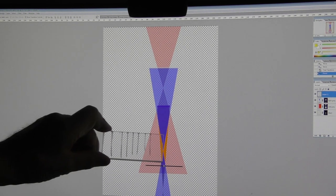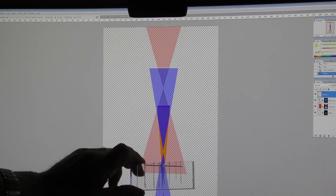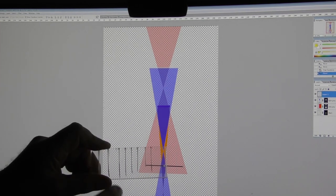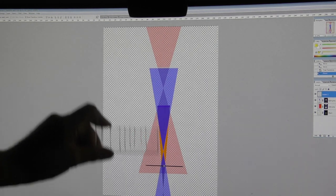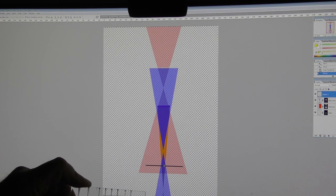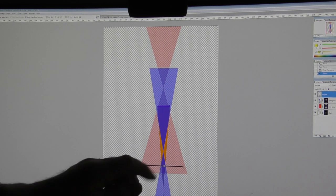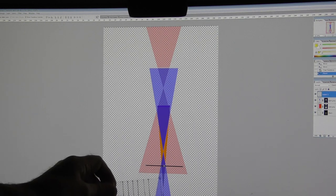And I've shown you how that cutting action actually takes place by virtue of an entry point into the material. There is no focal point that's causing this. That was something that kept on dragging me off to one side, that this spherical aberration had got focal points down here, which were the cause of these things. It's nothing to do with it. It's all to do with this entry point where the beam enters and the size of the beam at that entry point. And then we're also talking about the intensity of the light at that point.